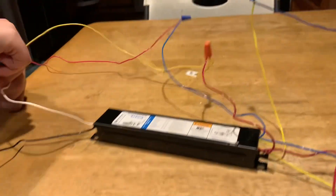All they needed to do was this. Ladies and gentlemen, basically all they had to do was match wire for wire, color for color — whether they spliced it or ran it all the way out to the sockets. Doesn't matter. If it's a good splice, there's no issue. It still needed to be wire for wire, color for color. You can even mix up the blues and the reds, and it'll still work — not exactly right, but it will work.